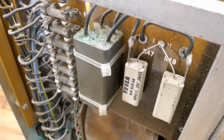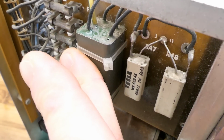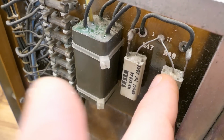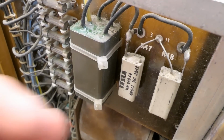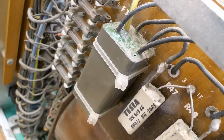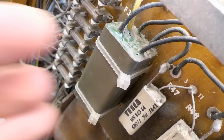And it actually sounded like the popping came from this interference filter, which actually is hot, and it's not heated by these resistors. The resistors are actually cooler than the filter. And of course an interference filter shouldn't be hot, especially when running the power supply with virtually no load. And I was actually told that the interference filters in these, or these filters in general, are quite problematic.